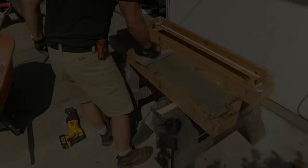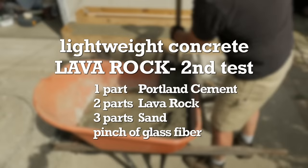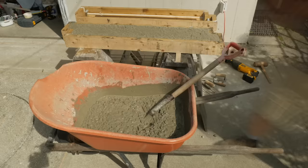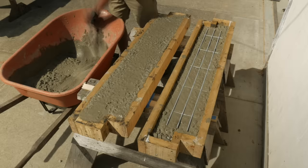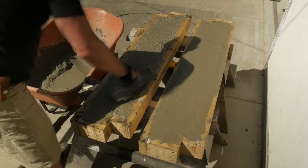For my second attempt, I changed the ratio a bit. I went with one part Portland cement, two parts lava rock, and three parts sand, and again a pinch of glass fiber. I figured I needed more sand to get a smoother mix. I started the same way — mixed it all up in the wheelbarrow — and it came out a bit wetter than I liked, so I added a bit more sand to absorb some of that water. I could tell right away that this consistency was closer to regular concrete. Same process: fill the mold halfway, lay in the reinforcing wire grid, then vibrate and smooth it out. I used a little bit of the extra mortar-type mix to improve the surface finish on the first form, and this seemed to work pretty well. I covered the forms with plastic and left them to set up.